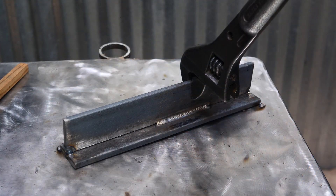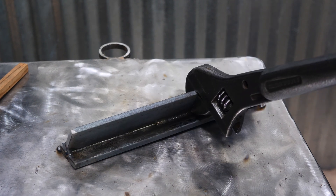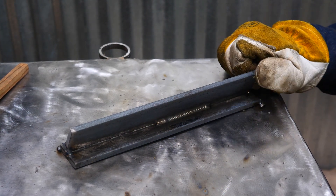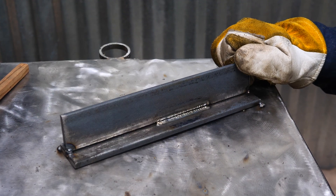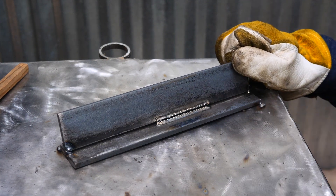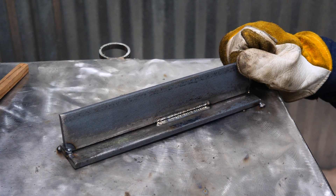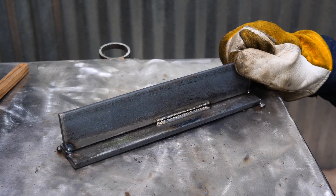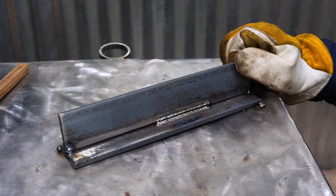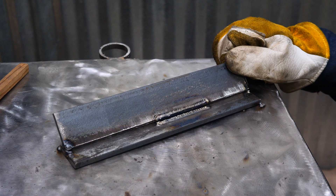I've got a little bit of leverage on my quarter inch plate here and I'm just going to gently pull this down — and there it is, a centerline crack right down the face of the weld. That was not hard to break at all, maybe a couple pounds of force. This really shows the power of weld throat. If I had sufficient throat there is no way I could do that by hand. Of course, this is an extreme example — we did an autogenous TIG weld with no filler metal — but I really wanted to show the importance of a proper throat.